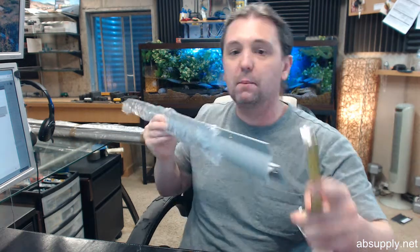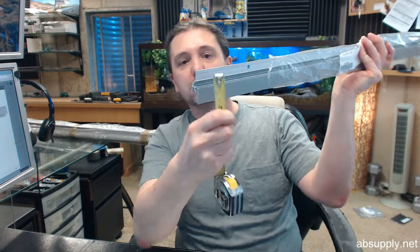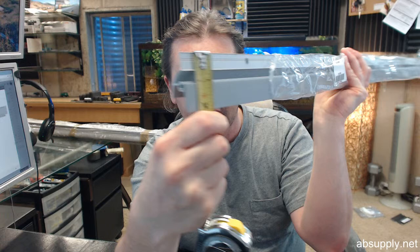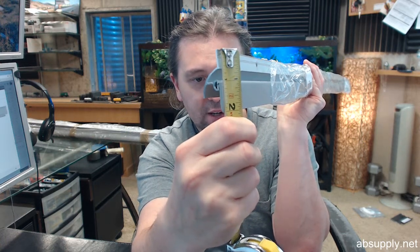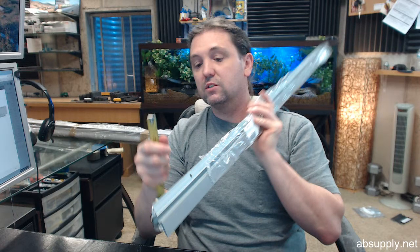There's an image below this video of the cross section showing you the important dimensional properties. Let's go over that now. It's a 2-inch overall height. 1.5 inches is the height of the extrusion, so obviously you're going to need to be down here where it's making contact with your threshold. Now, the other thing is, what's the projection? They don't give that. They're typically 9/16, but this one certainly appears to be greater, and certainly it is. It's about a 3/4-inch projection on that drip cap.